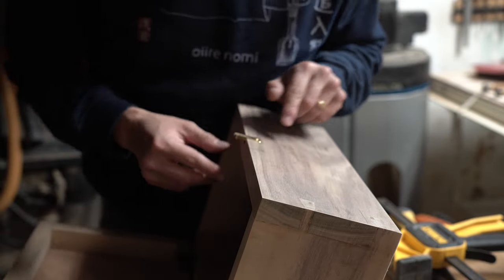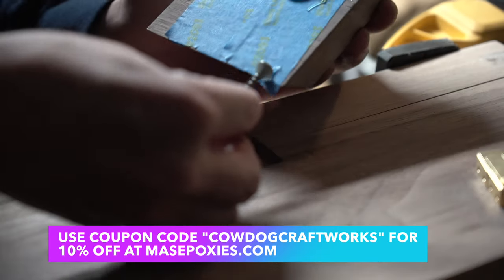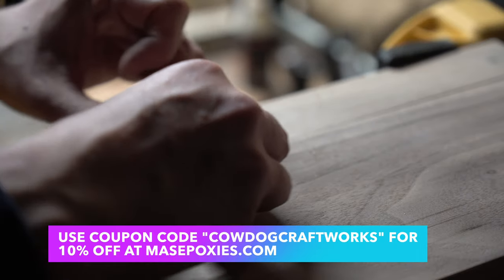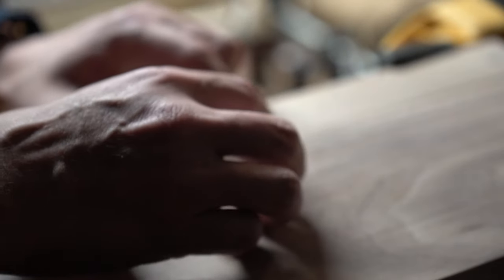To set the latch in its mortise, I'm using Crackzilla from Moss Epoxies. I needed a more pointed location to apply the epoxy to, so I used cutting edge technology with a drywall screw dipped in epoxy to apply it in the top and bottom of the mortise so I can set the latch in.